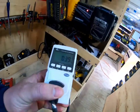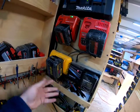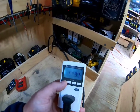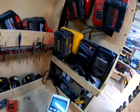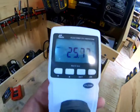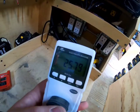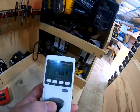We're at basically 0.4 kilowatt hours — 0.39 kilowatt hours — to charge everything up. This is just a 6 amp hour at 20 volts and 3 amp hour at 60 volts. The kilowatt hours is actually what I'm looking for, because your batteries have a kilowatt hour ranking. Another great metric is the watts — it was just over 900 watts when everything was charging. A 1000 watt inverter would be sufficient but you're at max capacity. I'm going to take these numbers down for future reference.